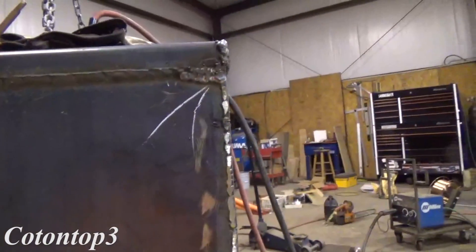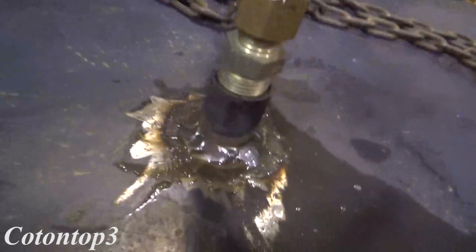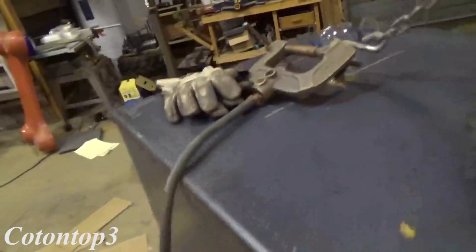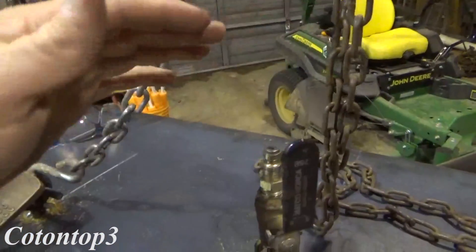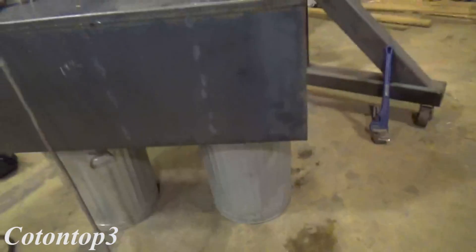There she is — she's done. I fixed the seven pinholes: that one, that one. I entirely re-welded the vent — I ground it out and entirely re-welded it. Got it, that one, and that one. She's holding air right now. You just take the grinder — like I said before — grind it out and weld it back up with no air in it. You don't do it with air.